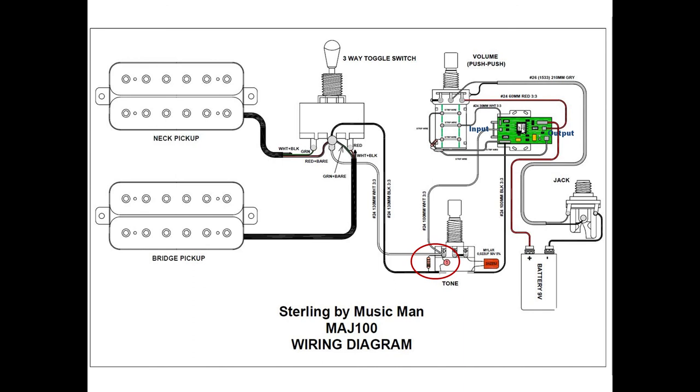Completing our analysis: the red wire goes to the battery — that's a 9V DC. We have a ground point here and another ground point here. We also have a point that goes to the push-push switch, which is what we call the boost volume control. When the push-push is down, this point connects through a 220-ohm resistor to ground, and when pushed up, it connects directly to ground.